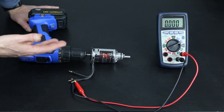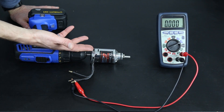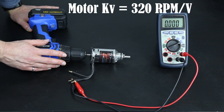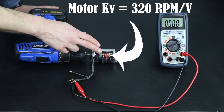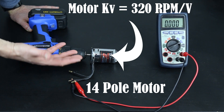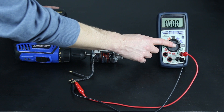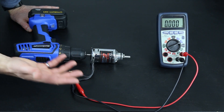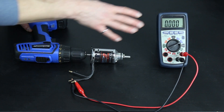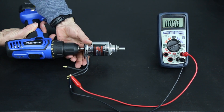The faster you can spin the motor up, the better it is going to be for you. The last item most obviously is going to be our motor. I've selected this motor — it's got a relatively low KV and you have to know how many magnets are inside of it, so you need to know the pole count of your motor. We already have the setting on our multimeter selected to frequency, so the next step is simply spinning up the motor and holding it at constant speed until everything settles on the multimeter and taking that measurement.